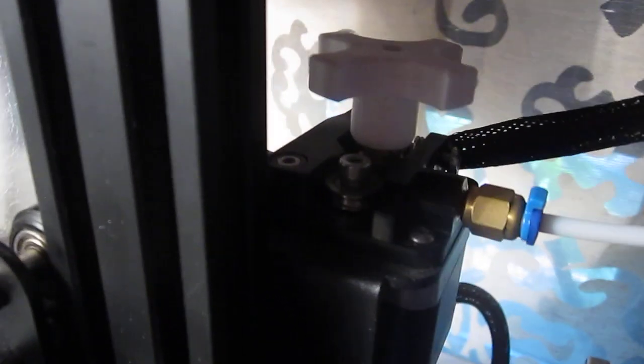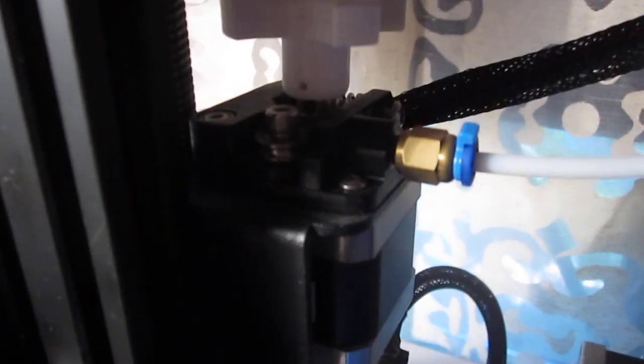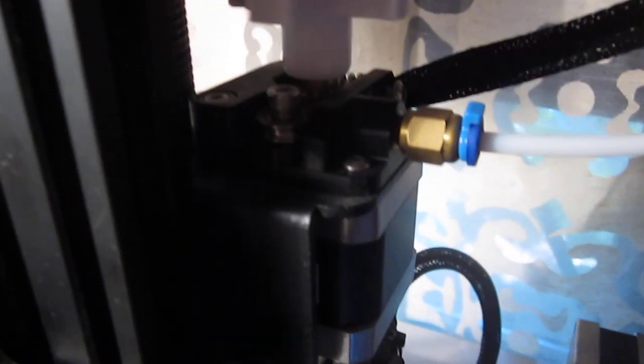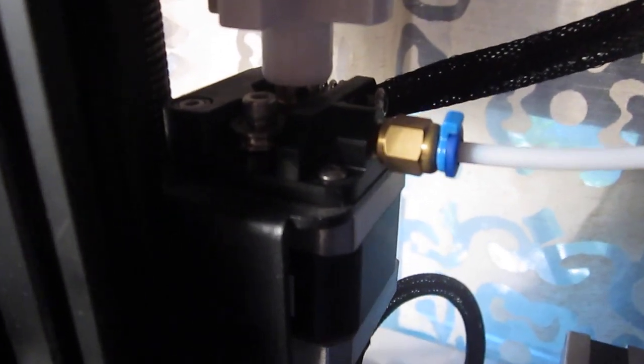Also, this is the plastic extruder body right here. You can continue to use that even if the arm cracks, or someone says, oh geez, it's a time bomb, this thing's going to crap out on you. No, it won't. I've been using these plastic extruders on 4 of my printers and 1 CR10S for over 3.5, almost 4 years. I print every day and haven't had an issue. Even if that crapped out right now, I think it's way better than the metal ones that seem to crap out all the time. It seems never ending. The metal ones seem to have problems this particular extruder will never have. So there you go, your decision. Keep the body, change the arm, and keep printing. You don't have to recalibrate, retweak, change the E steps and all that. So anyway, let's continue on.